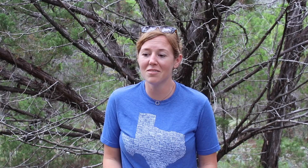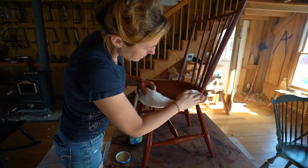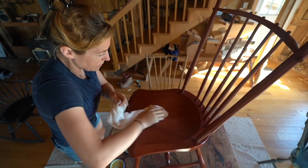Take your time on the wipe-down step to make sure you don't miss any areas, or it will dry with a different sheen. After going over the entire piece, let it dry for 24 hours before applying another coat. Check on it about 10 minutes after the first wipe-down to see if the surface is seeping out excess finish — that also needs to be removed. In total I put on two coats of paint and three coats of the top coat finish, applying a new coat every morning before we got to work on Greg's porch.